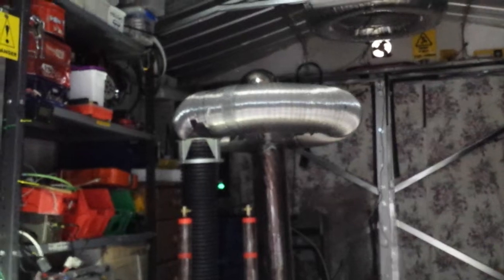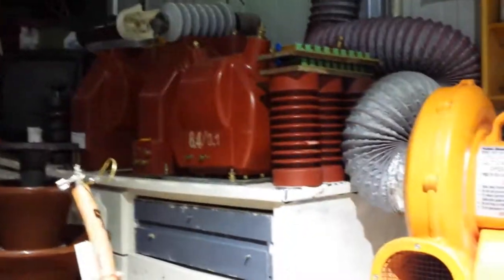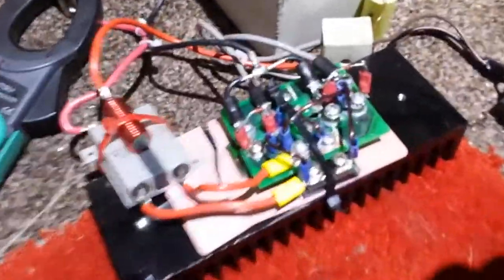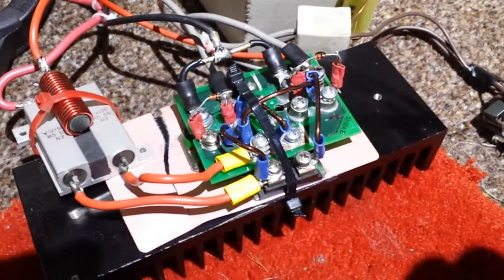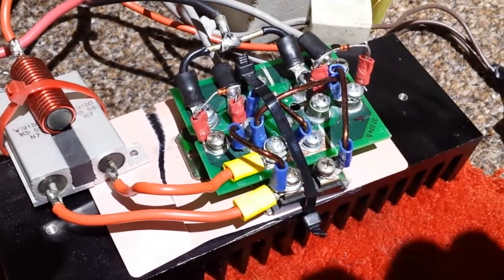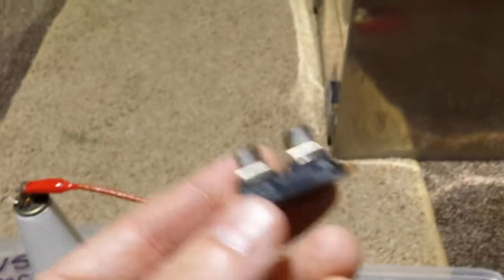She was working very well, wasn't she? Excuse the little ball on the top of there, it's a bit out of focus. Yes, she was working very well indeed. I was powering her by the 8.4 kV potential transformer. So in today's video, I've actually made a driver which is very similar to a ZVS driver, but it's using these smaller package transistors, just like these sort of things. They're like an IGBT, but they're a lot smaller, a smaller package. Let's see if I can get this thing to focus in on these.